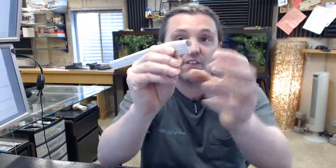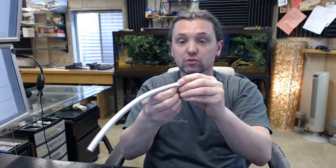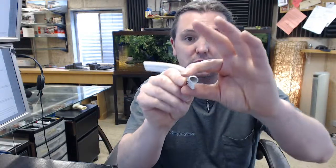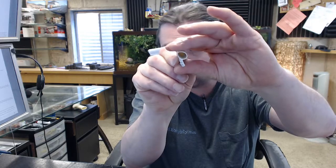The minimum space between the door face and the stop is 1/16th of an inch, and the maximum space is 3/8ths. I would say you are going to want more than a 1/16th minimum because that would be a lot of compression. I would choose to be closer to 3/16ths to a quarter inch — I don't want too much compression of this material or for it to be fatiguing constantly.